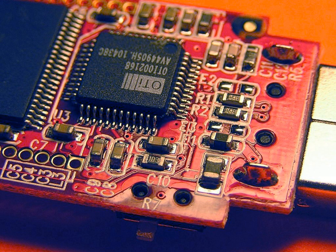the circuit board. Both technologies can be used on the same board, with the through-hole technology used for components not suitable for surface mounting such as large transformers and heat-sinked power semiconductors. By employing SMT, the production process speeds up, but the risk of defects also increases due to component miniaturization and to the denser packing of boards. In those conditions, detection of failures has become critical for any SMT manufacturing process.